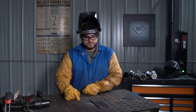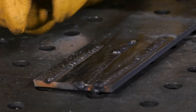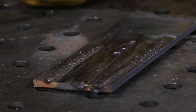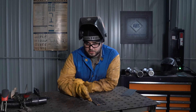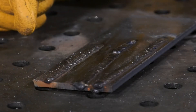Problem four: amperage. Not enough — too little amperage results in a narrow bead. It'll be difficult to maintain the arc, and a lot of times it may stick. You'll have trouble letting the bead wet out into the material, and you get a very convex profile, which gives you that tall bead.